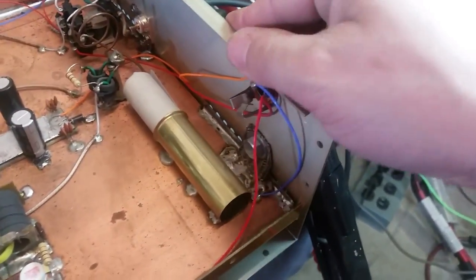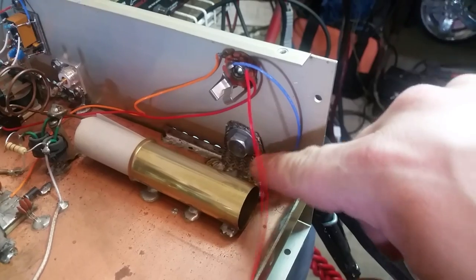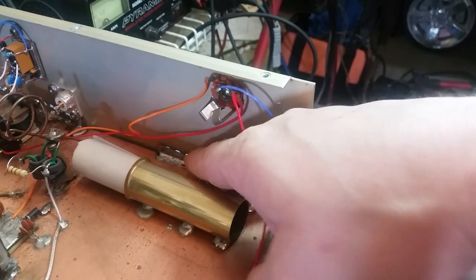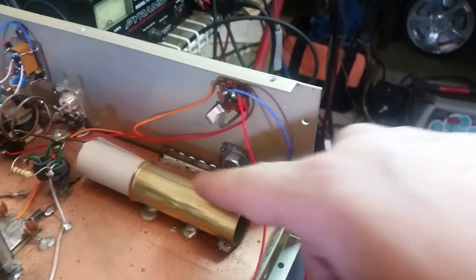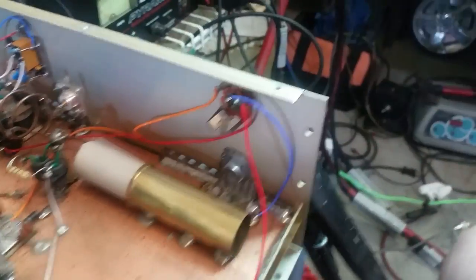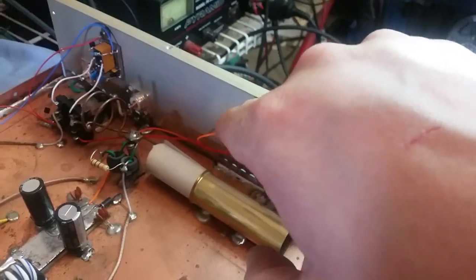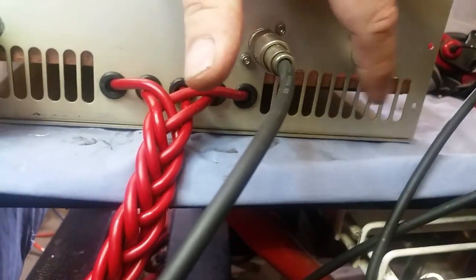And once I get the top on it, I'll push this forward. As you can see, which I've already explained, I custom cut some copper down here to hide the air holes from the port that you can see from inside. And as you can see, you still see a little bit of the top of the port right there. Once the top is put on, this is pushed forward, that right there will not be shown anymore. But I did the best that I could on there. It's definitely going to restrict the airflow from coming out the top of this, out those ports now, and all the air is going to be pushed through the heat sink out the back. You can see the evidence of that right there, because that's the port that's being blocked now with that thin copper board.